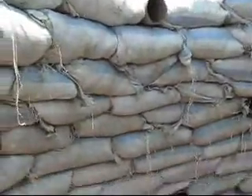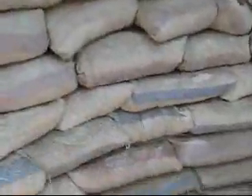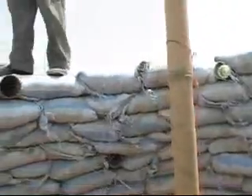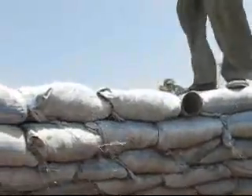This is not arbitrary stepping — the corbeling is actually calculated as per drawings, so all of this is as per measurements. Here you can see how the profile of the corbel dome will look once complete. It's actually by ring action that each ring stays in place and hence the dome is formed.